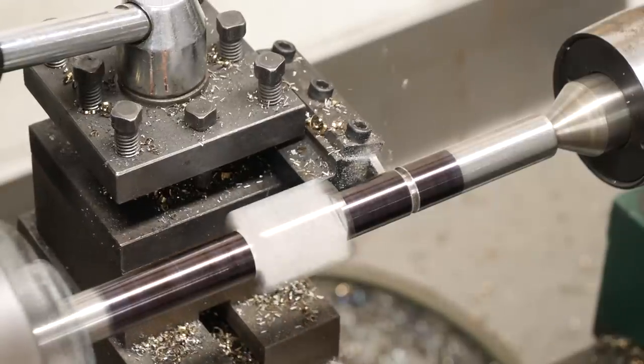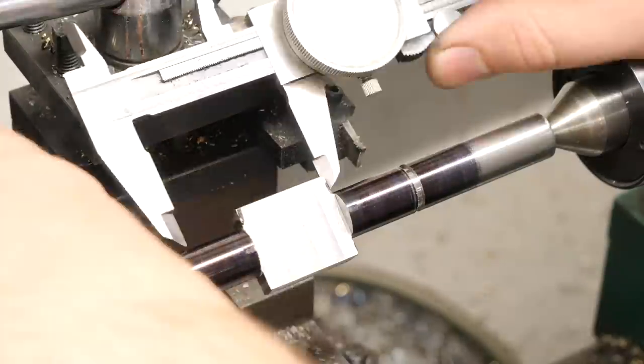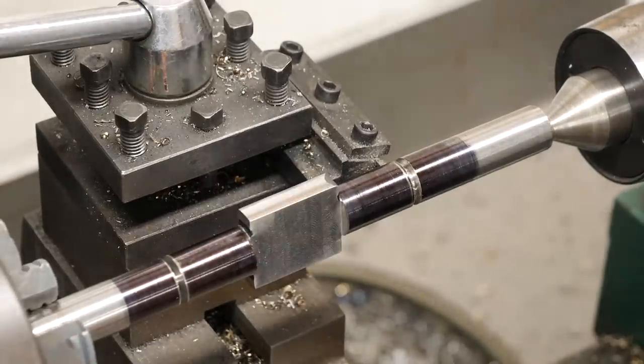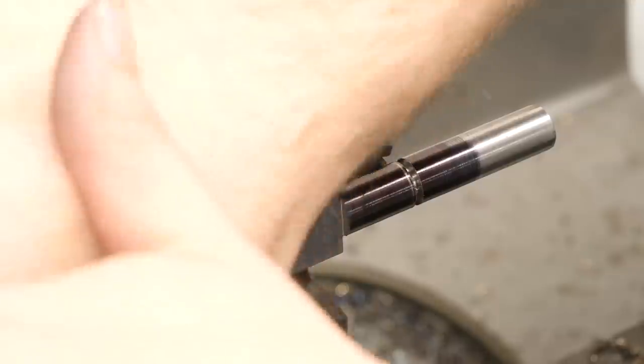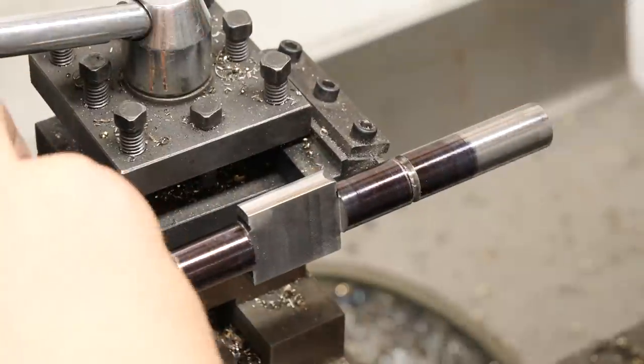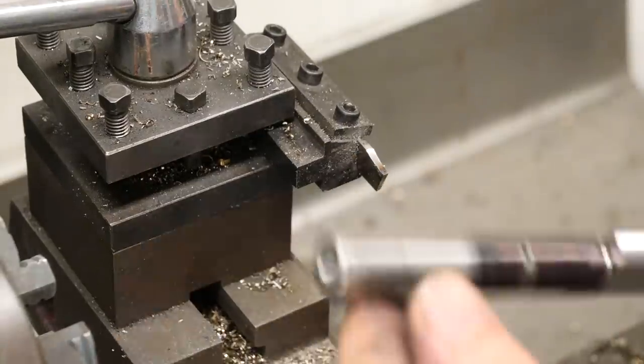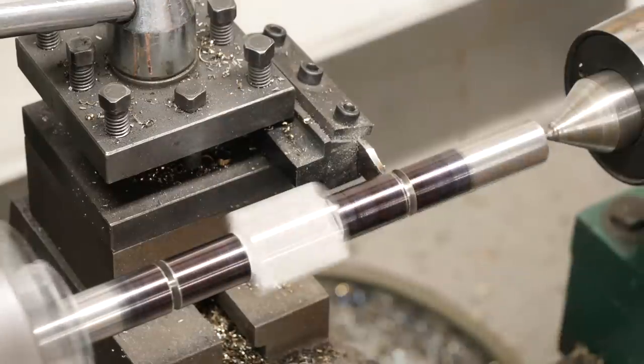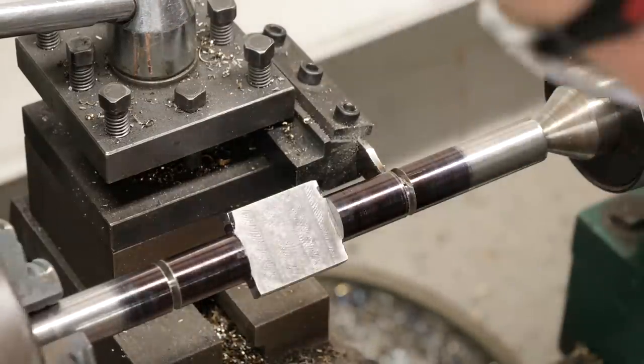I'm using a cutting tool to divide the metal and leave about a quarter inch in the center. Right there the cutter caught onto the metal too hard because it was a bad shape, and it got really hot. It kind of bent something on the guard and made it wobble when I chucked it back up, but I had plenty of material to true it back up again.